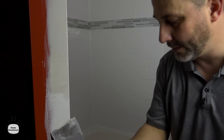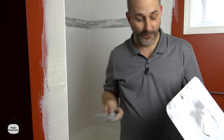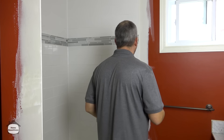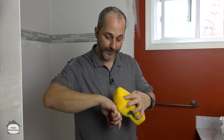This particular wall had to be resurfaced with a new corner because we changed the tub. I just started working on this this morning — this is now the third coat of mud I'm putting on here, and that is going to be beautiful. On this channel we try to show people all the tips and tricks for doing the work themselves. Remember, even the most complicated project still needs to have simplified finishing. A lot of people have commented asking about wet sanding and how to keep dust down, especially in a small space — this is the system for you.